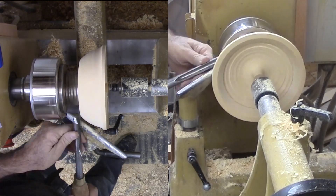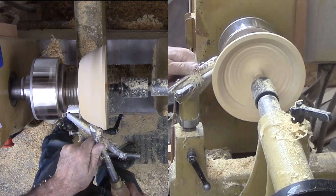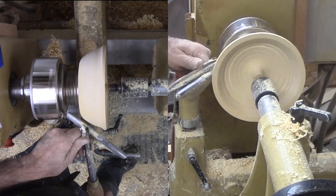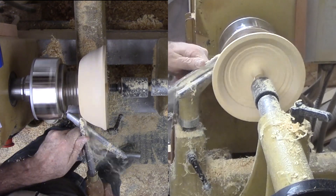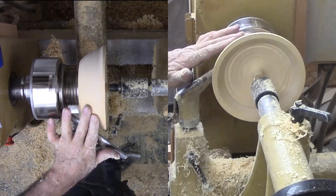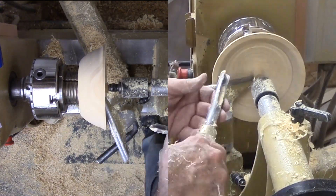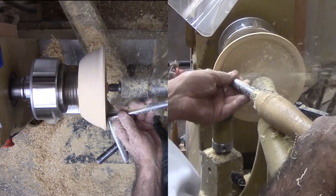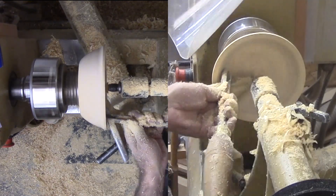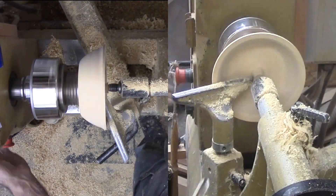Now back to hollowing the bowl. Since I had remounted the bowl again, I took a moment to trim the exterior slightly to remove any offset. Then back to hollowing the interior, removing that temporary mortise before the final hollowing. I still have the live center in place for security, especially with a small mortise mount. With most of the wood now gone, I cut out the remaining nub. Now I have to be more gentle with my gouge, then switch from my bowl gouge to a heavy bowl scraper for the very bottom.